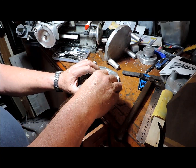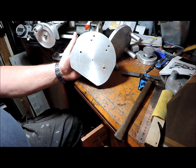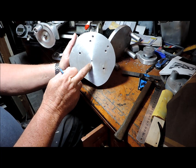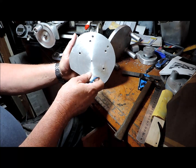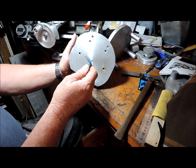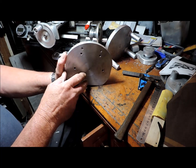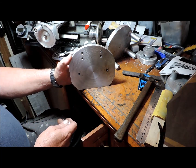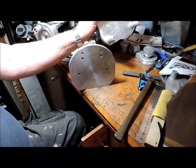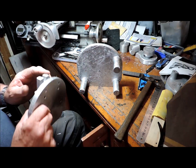This is the back frame and everything works off this face. That's the worm carrier, and the worm carrier then sets the position of the worm wheel. There's a marriage going on there obviously, but it all works off this face, as the other inside face is a bit hard to machine — I've got three legs in the way.